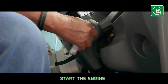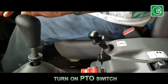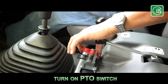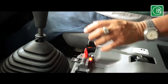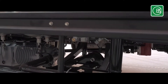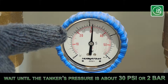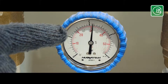Start the engine and turn on the PTO switch. Prepare every system to be ready. Accelerate the engine speed to between 1000 to 1500 RPM. When the engine speed has reached the power requirement, wait until the tanker's pressure is about 30 psi or 2 bar.